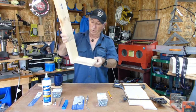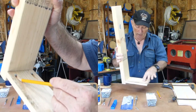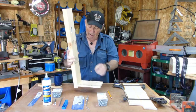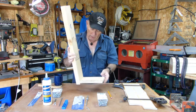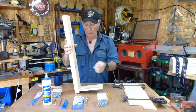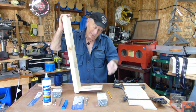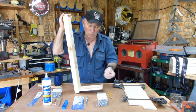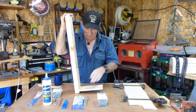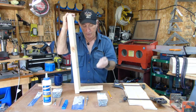With this piece of lumber here, this was a test — this was the first try and it didn't work. The second try did work, amazingly. But the next problem I had was a failure with the screws. This is just a 2x4 pine, so it's what I would call soft wood. The inch-and-a-quarter screw wasn't deep enough to give me the strength to make a respectable joint.